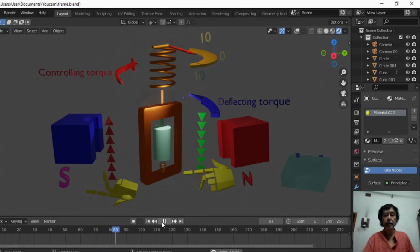Another important point is that these two horizontal parts of the metallic frame, that is, the rectangular coil, the current in these horizontal parts is parallel to the magnetic field. We know Biot-Savart's law, I dl cross B, dl being parallel to B, dl cross B is 0. So these two parallel components of the currents do not create any effect on the throw of the coil. So this is the physics behind the rotation of the coil.